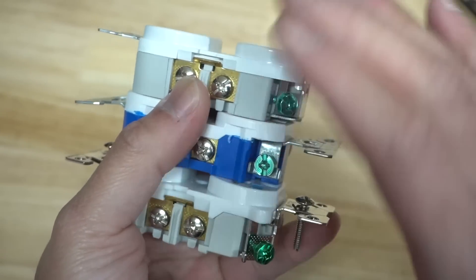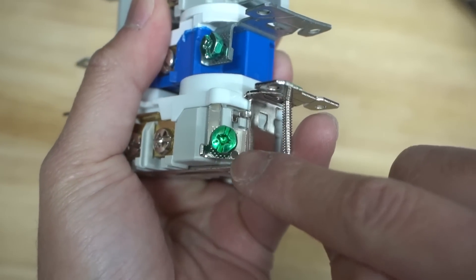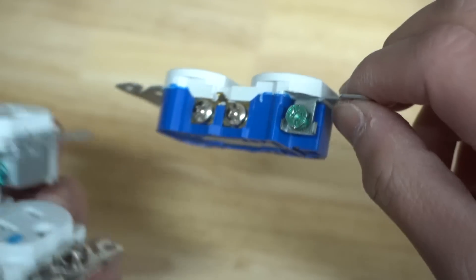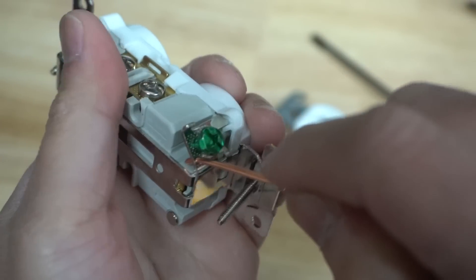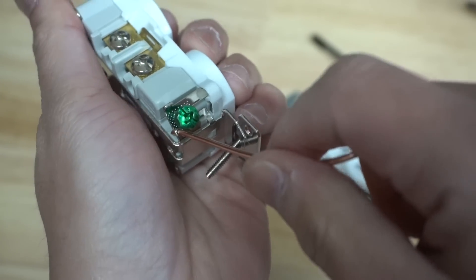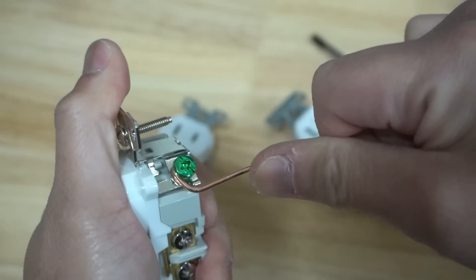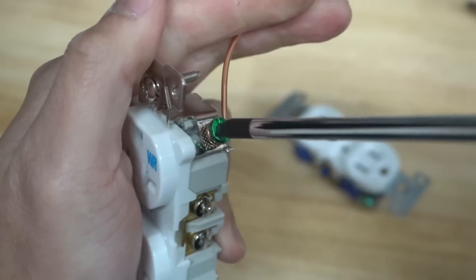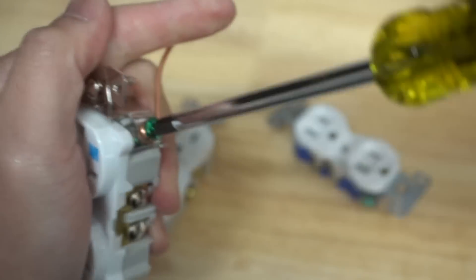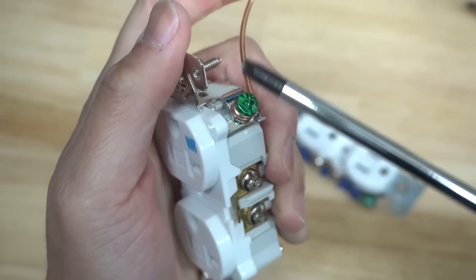Here's another cool feature — and again, not all outlets have these. If you look at the ground wire area, you can see there's a little hole right there; this residential one doesn't have it. It's kind of like a speed feature — you can put your wire through that hole and guide your ground wire right through. Then you can tighten it up. Always tighten in a clockwise manner. Nice and fast making that shepherd's hook.